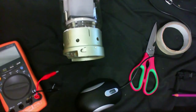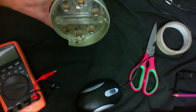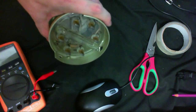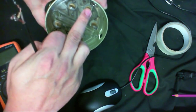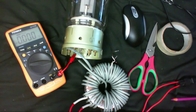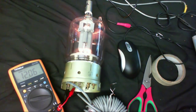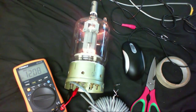Here we go — we're going to see if my homemade transformer is going to power up the filament. I'm pretty sure that it will. I've marked on the base of the tube which connection goes where — these are the two filament connections, and there's the filament center connection which I'm going to leave alone for now. I'm just going to connect the transformer across those two connections. Alright, my transformer's connected and I've got my meter connected so we can see the voltage. Let's plug in and see what happens. And yes, it is — almost effortlessly. We've got about 12.08 volts.